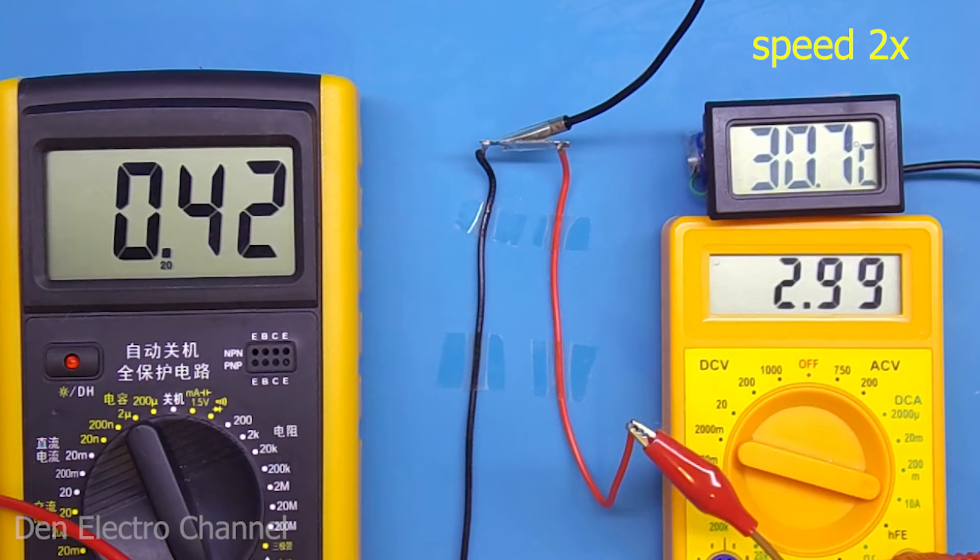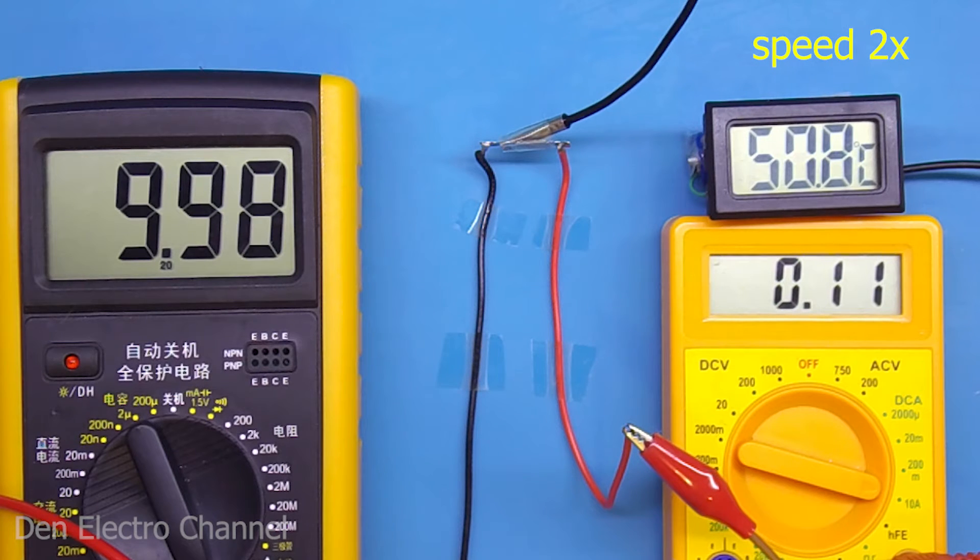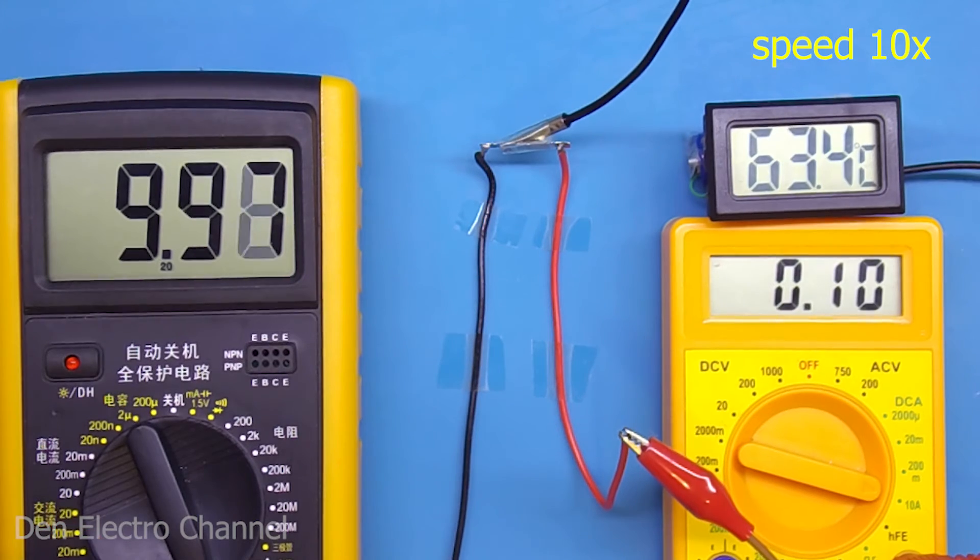I increase it further to 3 amperes. The voltage stood still at first but then began to grow. Please note that the current stays the same, which suggests that at some point the resistance of the fuse began to increase. Then it was as if the circuit had broken — but in fact this is not a complete break, since current is still flowing through the circuit, only 120 milliamps. Temperatures are still rising and much faster than before. I kept the circuit in this state for about half an hour, and the fuse reached a temperature of approximately 64 degrees and it did not rise further.